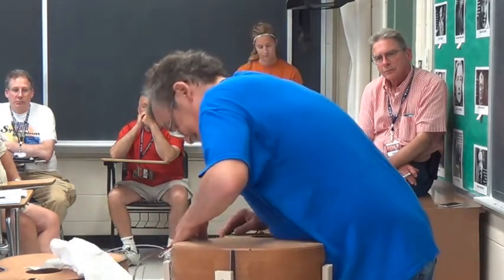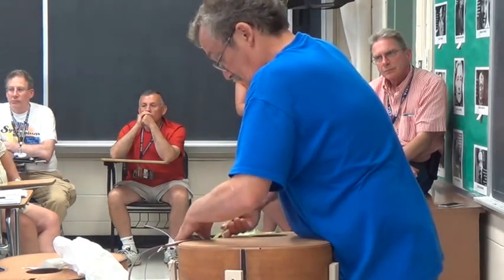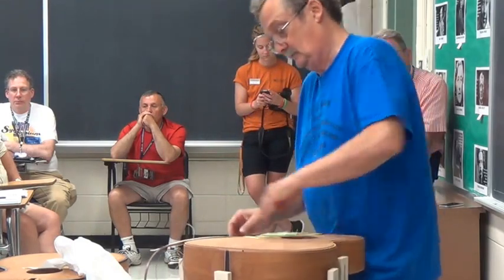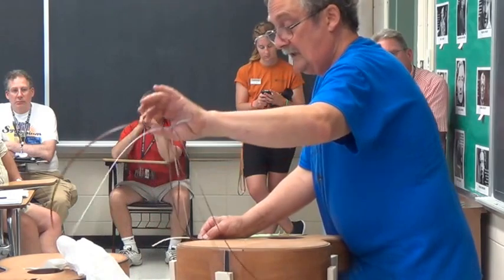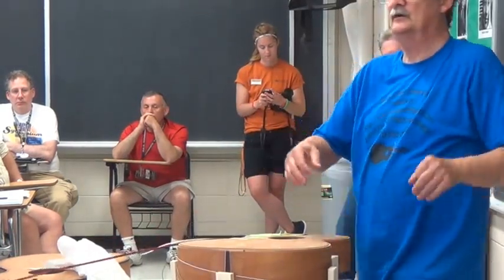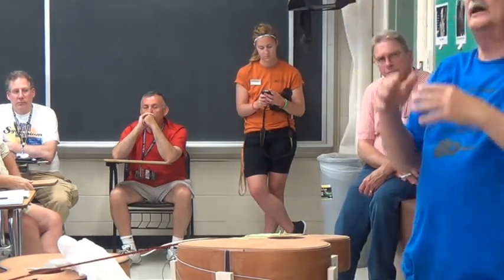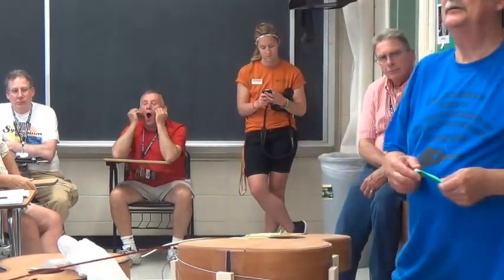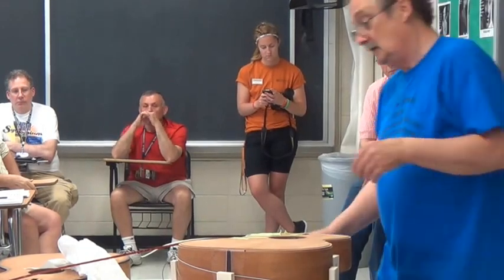Is there a real trick to getting the purfling to not get swirly? Obviously, you've got potentially three or four different heights of purfling, pearl, binding, all the channels at the same time. Well, the big deal there is, when we get into setting up the router cuts, you really want to be aware that all of those different shelf levels are set. And to keep it from getting swirly, the glue will actually help you because it's working as a lubricant while it's wet and lets everything slide into position.